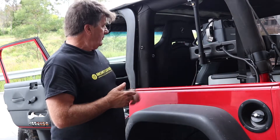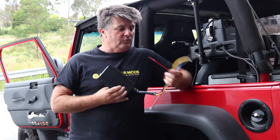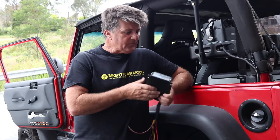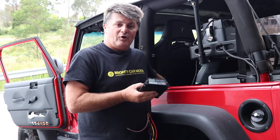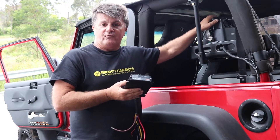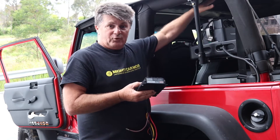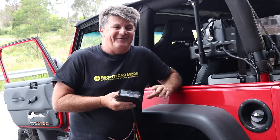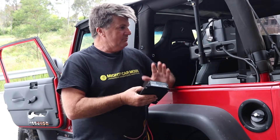The other thing I can do is use my Redarc 1225D. That will connect to a 12 volt feed and a solar feed, decide itself which one to use, and do everything I need. However, the problem is I can't run it into the 12 volt input of this all-in-one unit, because the Redarc wants to see a battery — not another BCDC unit on the other end. It needs feedback from a battery. I may have tried that already. It'll run for a little while but then just peters off and won't charge. So that's not an option.